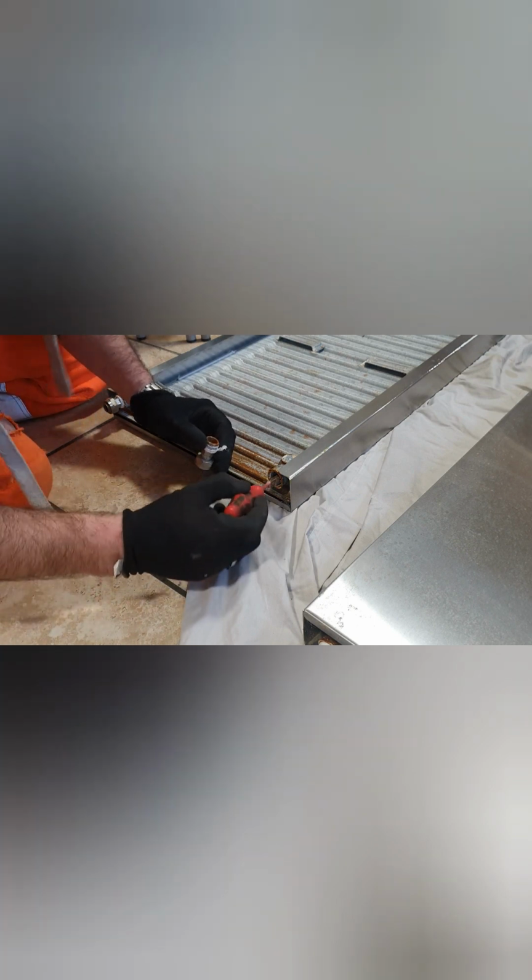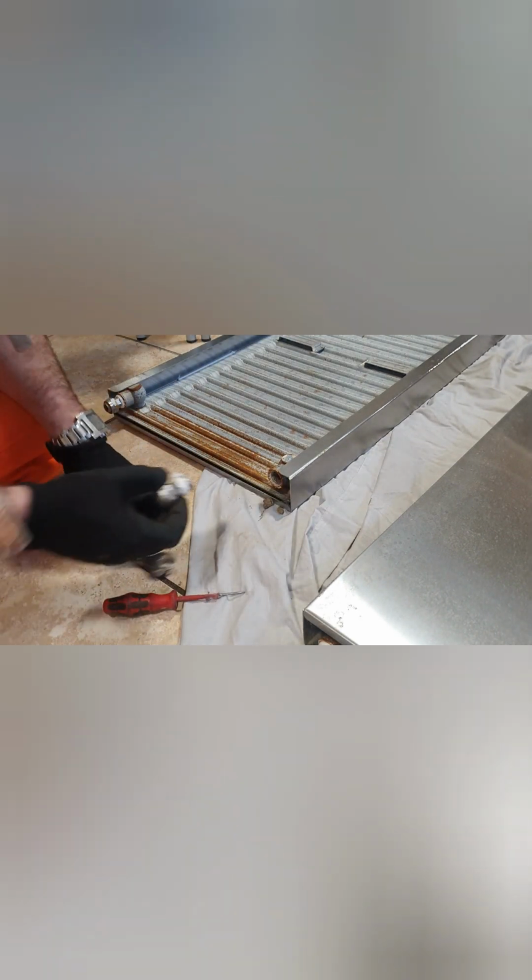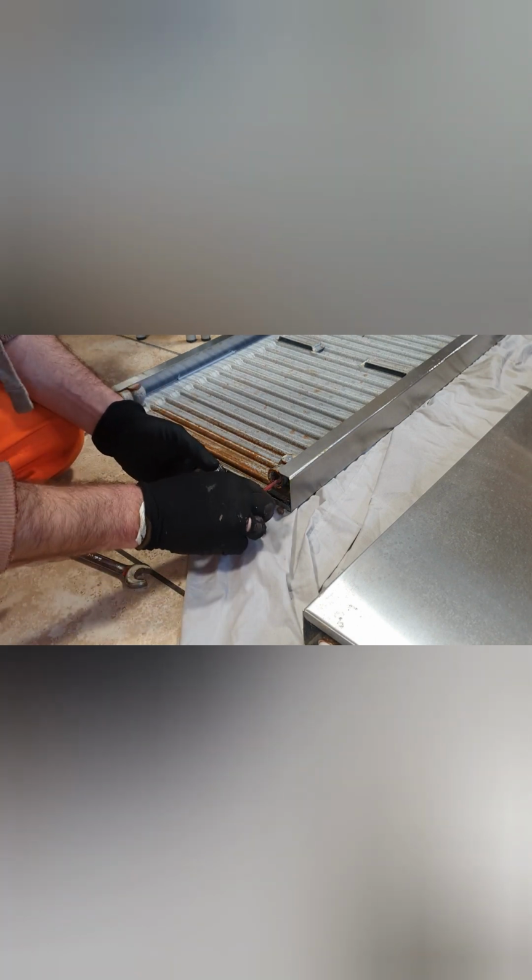Right, just going to whip this off. 16mm spanner. It looks like we may have to put a load of tape on it. Oh, there comes the mud plug. Like that. So yeah, it's got a load of PTFE tape on there. So when we get these with water flowing through them, we'll perhaps have to pop a load more around. Yeah, all the mud's out anyway now.